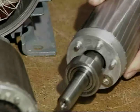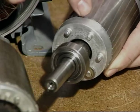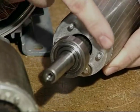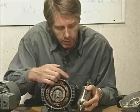Looking now at a rotor, we can see that the rotor consists of aluminium bars cast into slots connected together with solid end rings. With the rotor stationary, the rotating field moving relative to the rotor cuts through these conductive bars, inducing large currents into them sufficient to result in a second magnetic field which opposes the relative movement, giving rise to a force or torque on the conductors which causes the rotor to turn in the direction of the magnetic movement.